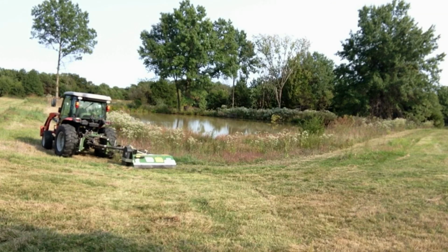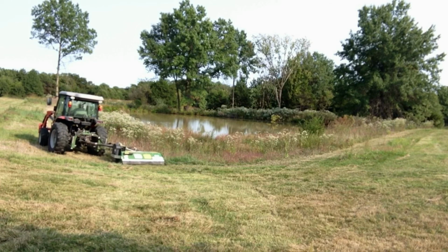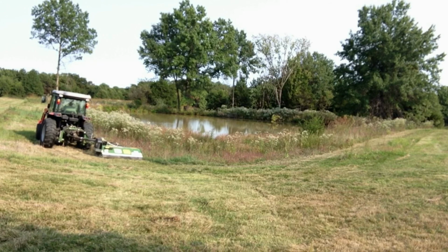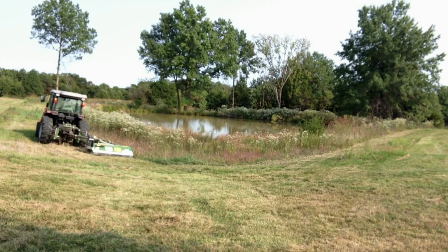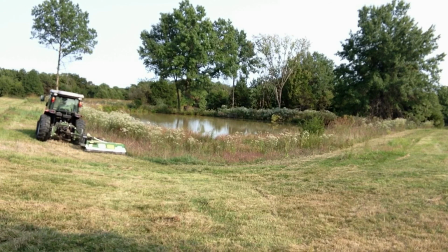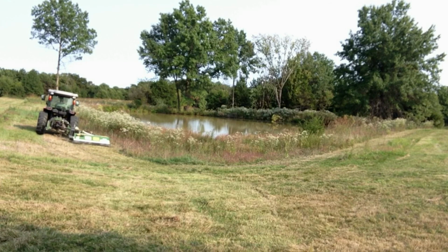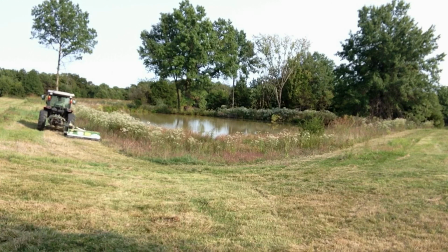But as I say, somebody had questioned me about the jerkiness, and you can adjust the hydraulics for the 3-point, for up and down. I could probably smooth that out a little bit. I have it pretty fast right now, so if I slow that down, that would help in lowering. You don't get that jerkiness lowering it down. Now going up, I'm not sure if that really helps or not. I'll have to look at the manual for that. I'm not sure if anybody knows out there, make a comment. But like I said, I know it does slow the drop.